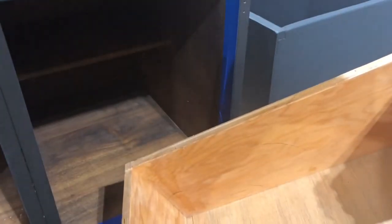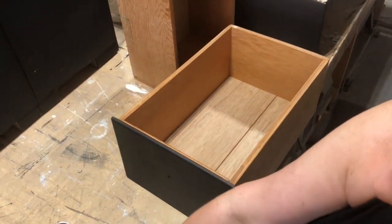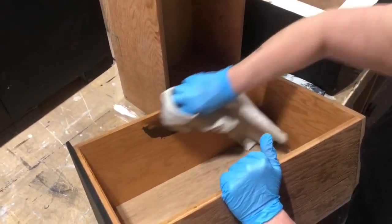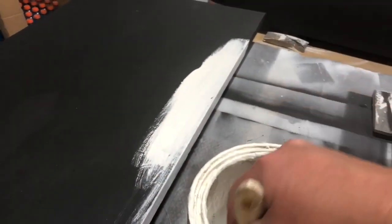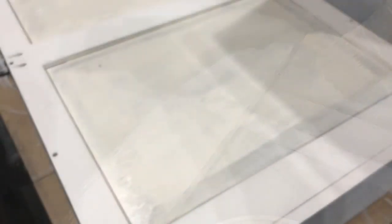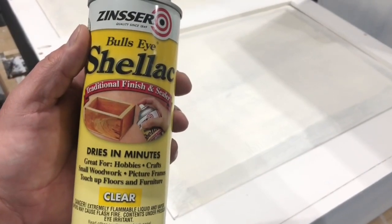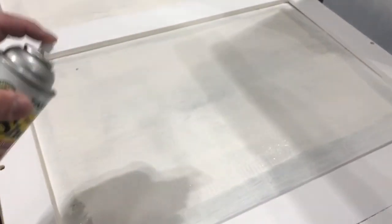With the drawer detail not matching the interior of that bottom cupboard, I used Waverly Antiquing Wax to get them a little closer — it gives that walnut look and just darkens them up. After a couple coats of Black Onyx — another ready-to-use right off the shelf at Walmart — we moved on to Kilz Paint and Primer in flat white, also right off the shelf at 20 bucks a gallon, to tie all the pieces together. Sometimes when you get into white paint on older vintage pieces, you get bleed-through, but there's a product called Shellac that stops it. You may need one or two coats, and we always wait to see if it bleeds through before applying.